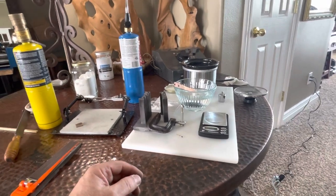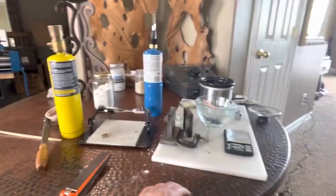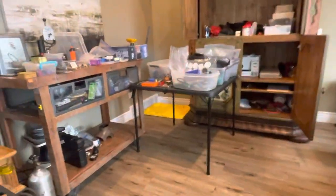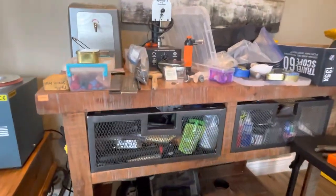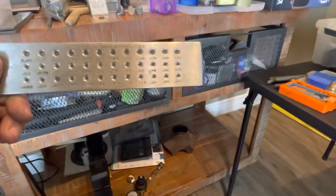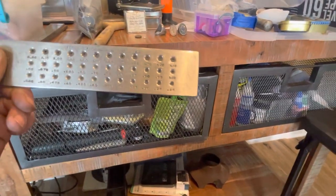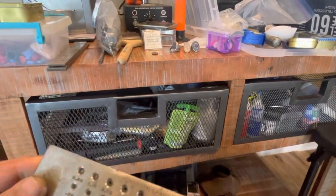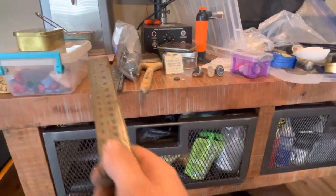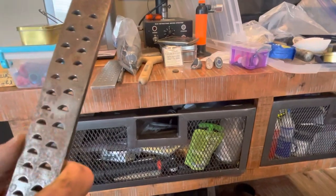Casting ingots, making some gold wire. Well, that square wire, you make it smaller and smaller, and eventually you can run it through these things called draw plates. Here's a tungsten carbide draw plate, very nice. Goes from 0.26 of a millimeter, I doubt you'd ever need that, to 2.2 millimeters thickness. And, you know, you can draw some half round wire, but that machine will make it.